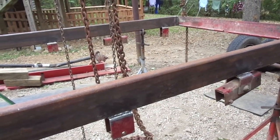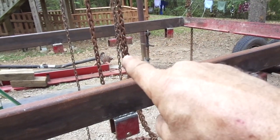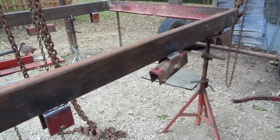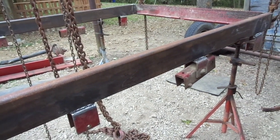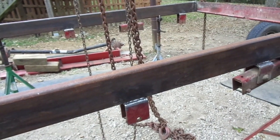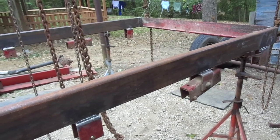Hopefully all my dimensions are correct. I've double-checked everything before I started sticking them. You can see the rear shackle, front shackle, and the center bogey on the passenger side and also on the driver's side — completely welded in and intact. Three passes on each one: a root pass, a filler pass, and a cap on top to pretty everything up and tie it all together. Everything is true and plumb, nice and square.